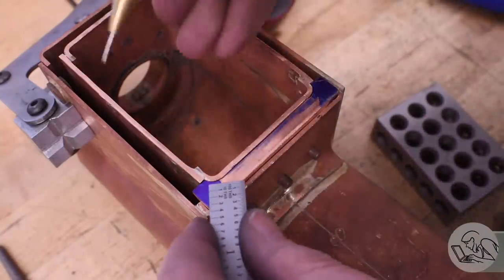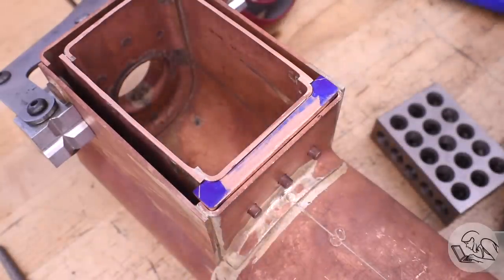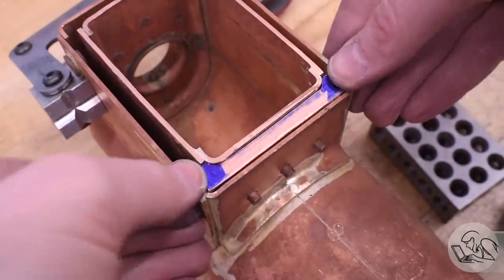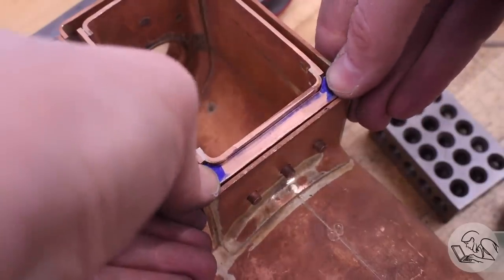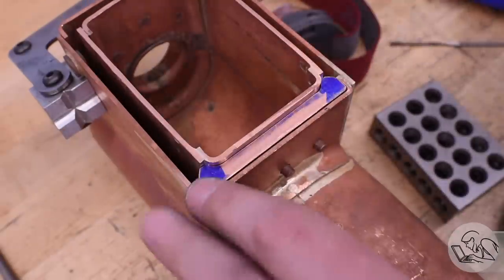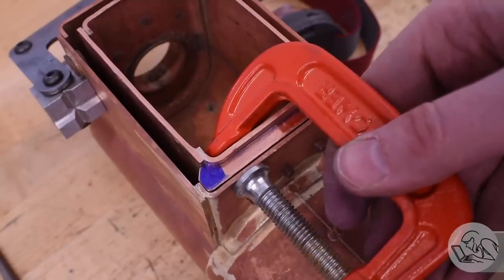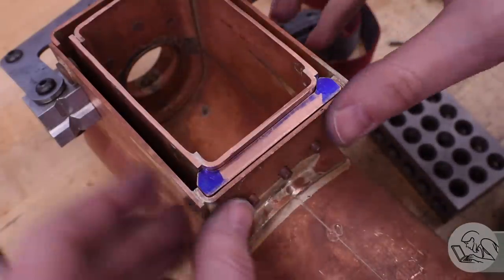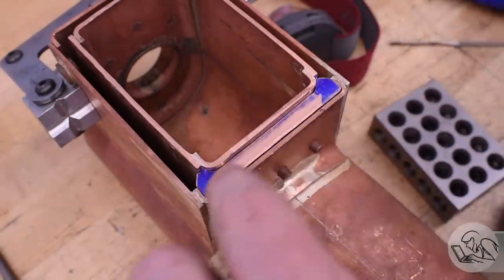Getting close now — I'm at the point where I want to knock those corners off. The corners between all these pieces on the foundation ring are mitered to each other at the extents of the sheet metal corners, and that is very, very close now. I'm at the point where I think I'm going to stop trying to fit the piece to the sheet metal, and instead fit the sheet metal to the piece. For that, I bring in a clamp and do some hammering to squeeze the sheet metal in a little bit — it's often easier to just move the sheet metal a few thousandths than to do a few thousandths more filing.